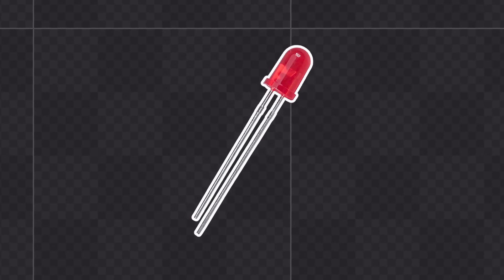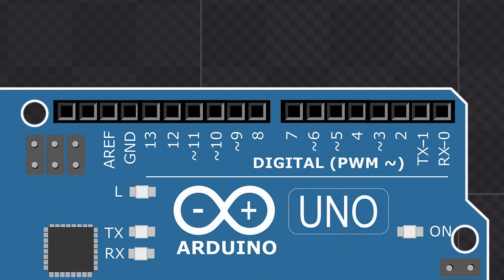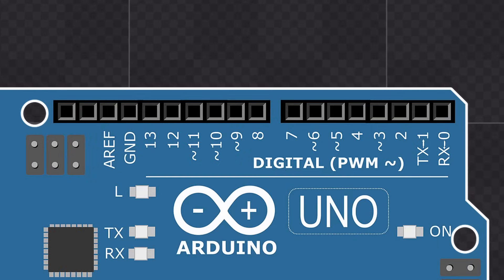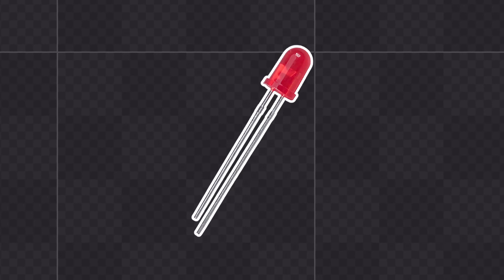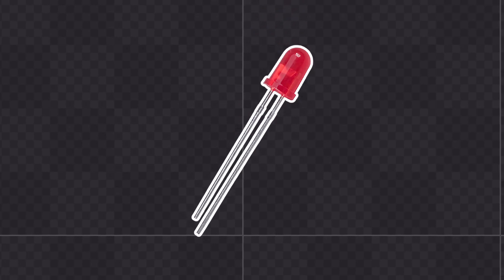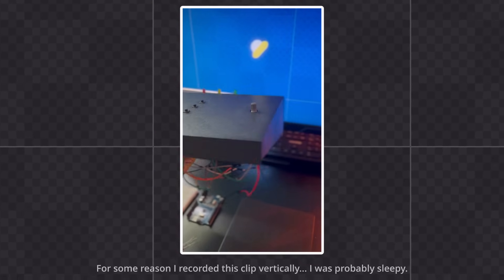Because we want to control the brightness of the LEDs, we need to ensure each LED is connected to one of the ports with a squiggly line next to it. This squiggly line represents a PWM port — you might be familiar with this if you've ever built your own PC — and it allows us to control the amount of power going to the LED. By adjusting the power we can make the LED brighter or dimmer as needed. I'm going to cut to all of this wired up, because I know something is definitely going to go terribly wrong.